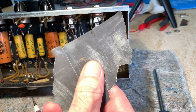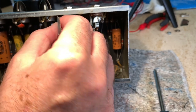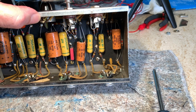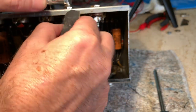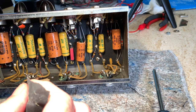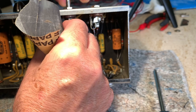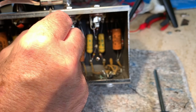See, some people will even go in there with a little piece of wet dry sandpaper and clean those out. And you'll see when you plug your guitar in, watch, it'll spread apart. It opens up that connection. And if you were to pull your guitar plug out and you still had a loud hum like you were touching the end of the plug right here, then that's probably a good indicator that this isn't making contact. Should probably never have trouble on a new amp.